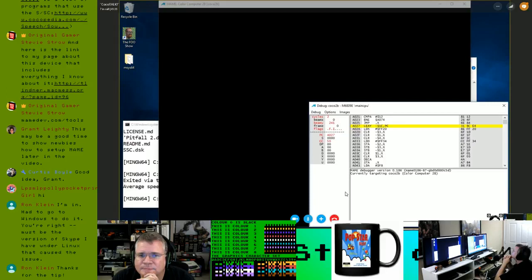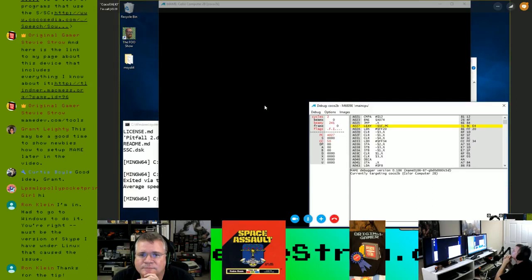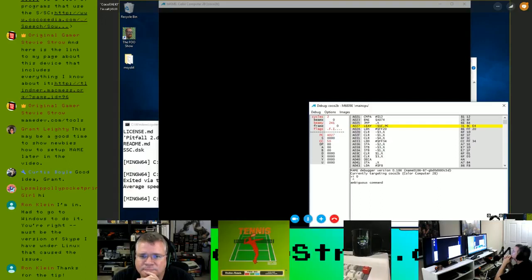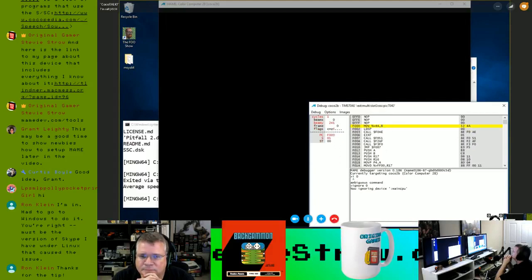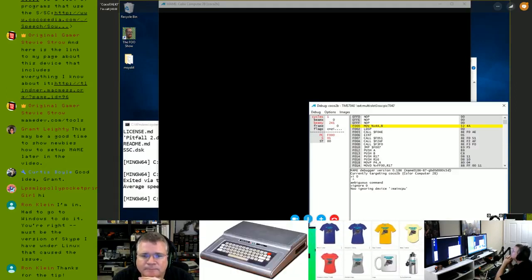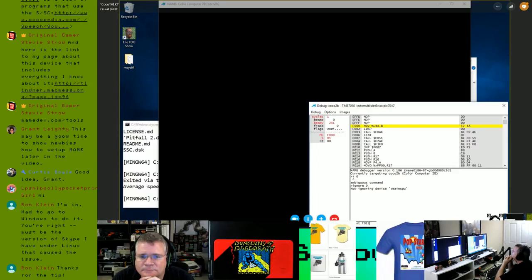So now we have the debugger that came up, and the speech sound pack is loaded up, and I wanted to first ignore the main CPU, the CPU number 0. And now I wanted to set a breakpoint for... When you say the main CPU, you're talking about the 6809 in the CoCo? That's right. I'm going to be setting a breakpoint in the microcontroller inside the speech sound pack.